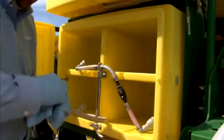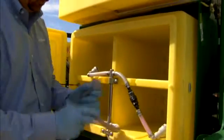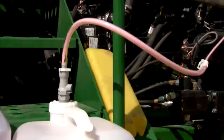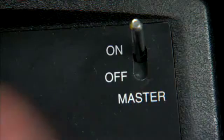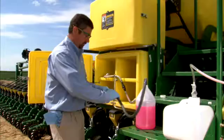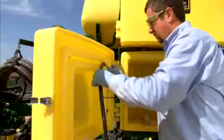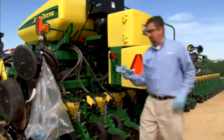Remember to wipe each connector clean with a damp cloth after disconnecting it from the flushing hose. You will need to run multiple priming sequences to fully winterize the system. When you've finished pumping antifreeze, turn the master switch off. Disconnect the RV antifreeze from the flushing hose and return the hose to the cabinet. Store any unused antifreeze in a safe place.